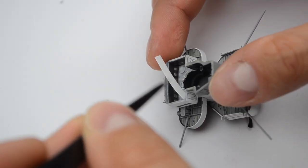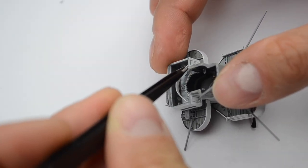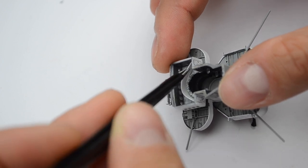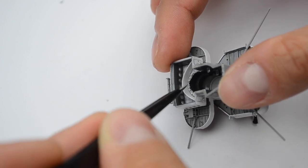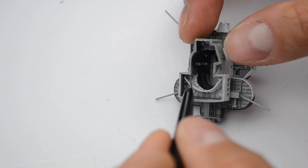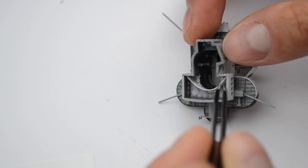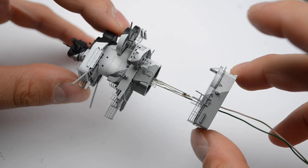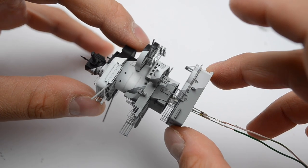This piece of thin white plastic will diffuse the light of the LED. I tested the installation's effect without this element, and the diode was visible through the windows. And now each window will be equally exposed. When the installation is inside, you can connect the elements.